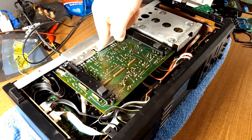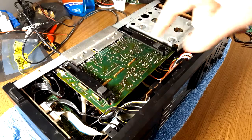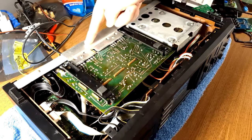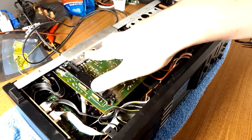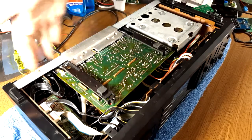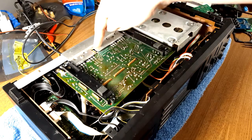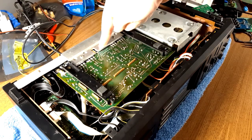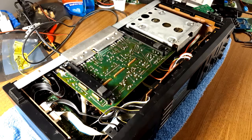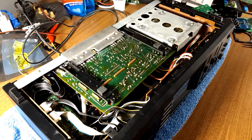You can tell Sansui was price-cutting with this amplifier because it's got a wee tiny heat sink. In an attempt to get even more heat away, from the factory they clamped on a bracket to the front of the transistors which is heat-gunked to the back metal of the chassis. On top of that, this has a six-blade metal DC fan in it, but of course it only comes on when the amplifier hits around 120 degrees Celsius.